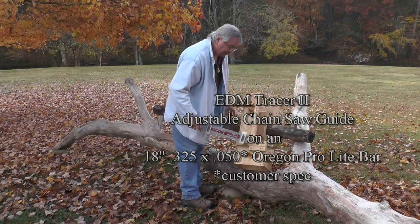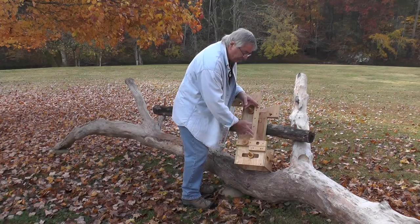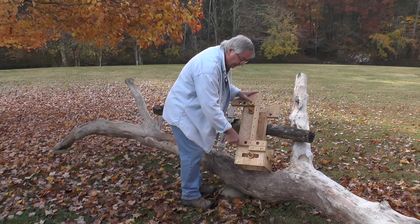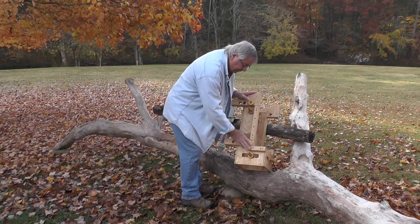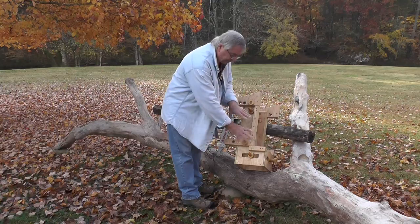This vertical seat up through here with this chainsaw attachment. Now the bottom — there were two dimensions that the customer wanted: he wanted a nine and a half and he also wanted an eleven and a half. So rather than make several different templates down here, I elected to make this just a simple pop-off and reposition so that he can achieve the eleven and a half inch depth without changing a lot more.